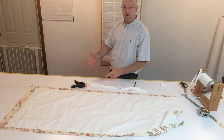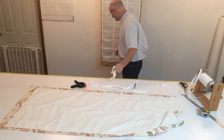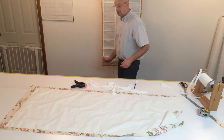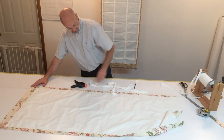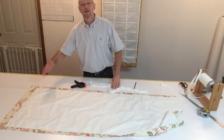To recap: the shade is 30 inches. You don't cut the tape 30 inches even though it's a 30-inch shade — you have to deduct whatever the bottom hem offset is, wherever you're going to start it. In my case, I'm starting 5 inches up, so I deduct that from my tapes, which makes them 25 inches. 25 inches plus 5 inches from the hem equals 30 inches.